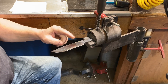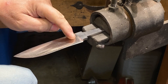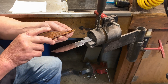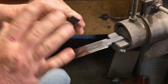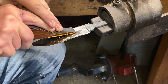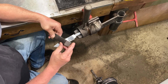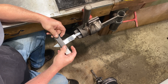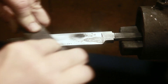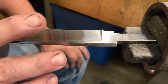It's time to start hand sanding. I like to start with a little tool I made that lets me get in here and work these plunge lines — this is where you have the most issues with scratches, it's hard to get them out right up against the plunge lines. This tool allows me to do that. I've got one for flat sanding and one for hollow grinding that's contoured like the shape of the wheel. We're going to use this to work the plunge lines. Then I've got a hard piece of steel with paper wrapped around it and we're going to start sanding the blade at a slight diagonal — this is 400 grit.